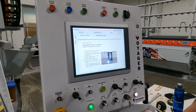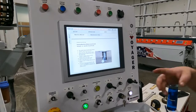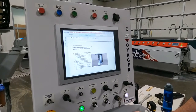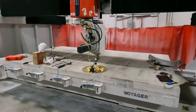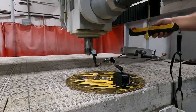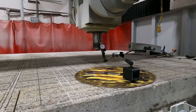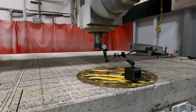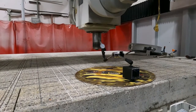Now I want to drive away in the Y positive. I want to position my C at plus 90 and A at 90, which is going to rotate that head completely around, keeping A at 90 degrees. From my experience in the field, this indicator will actually wrap around zero twice. In order to know where we need to stop, we need to watch how many times it goes around zero as we move it away slowly. So when I bring this back forward after we rotate it, I need to come to zero the first time and stop — not the second time.